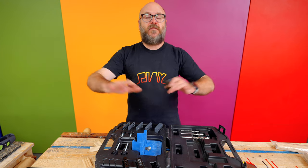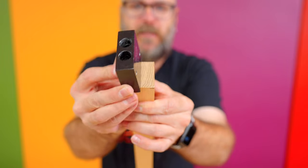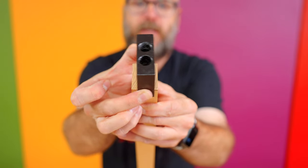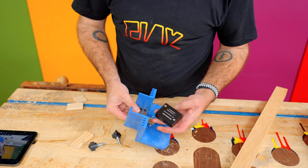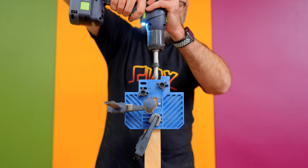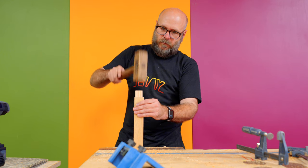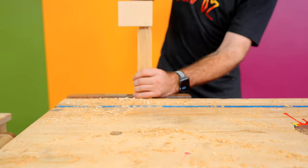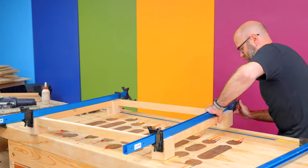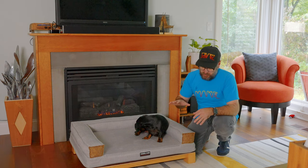So I want to give you an example of using the bigger half-inch drill bit and the spacers, because I have this base I'm making that just needs a bigger, stronger tenon. This piece is a lot thicker, and if I just put it in the jig as is, it's not going to drill those holes in the center. So I need to add a spacer to the jig, and then that will align things in the center of the board. Throw that in there, then the insert, and screw that in — and that spacer offsets the drill guide. I used the larger half-inch Beadlock tenon with the spacers to make this bed riser.